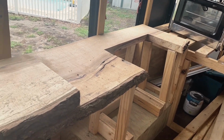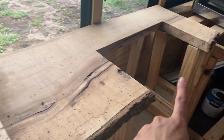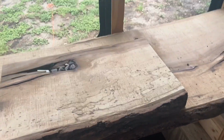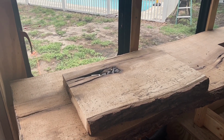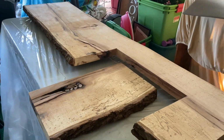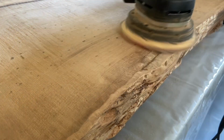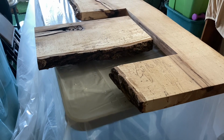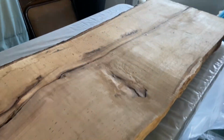I just filmed a whole time lapse of me sanding the top and bottom of the whole countertop and the top and bottom of our little cutout piece from here that we're probably going to use up there. And I realized I didn't hit record. So it has been sanded with 220 grit sandpaper on a rotating 5-inch circle sander. So everything is sanded and prepped already. Now it's just the scary part of actually mixing it and putting on the first seal coat.